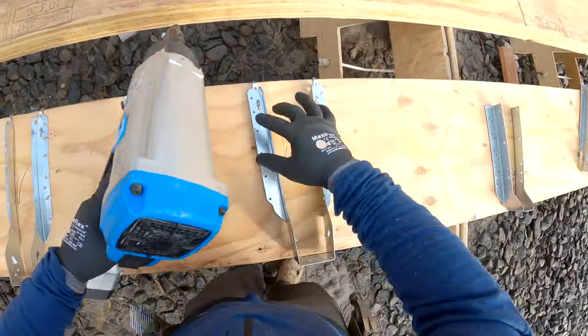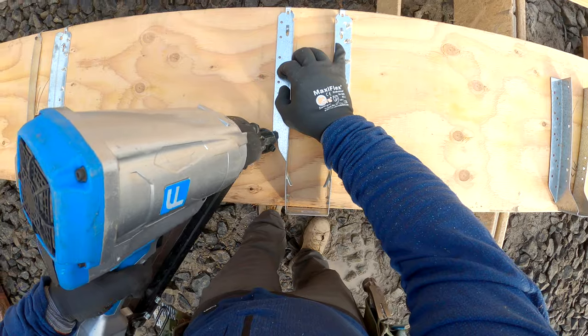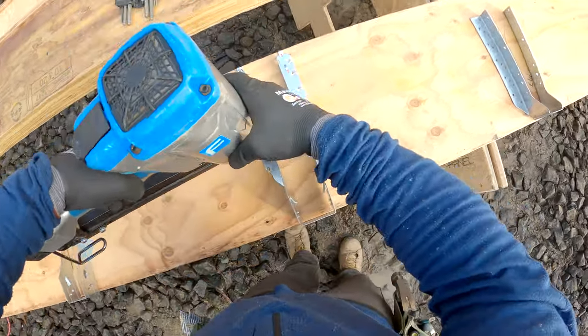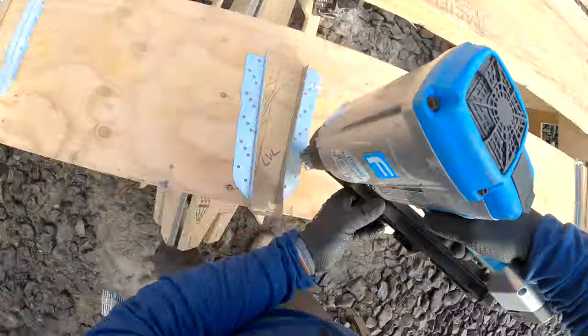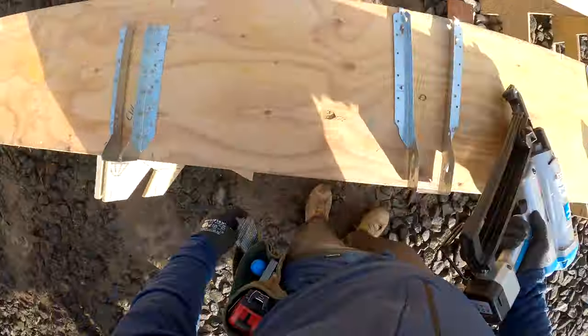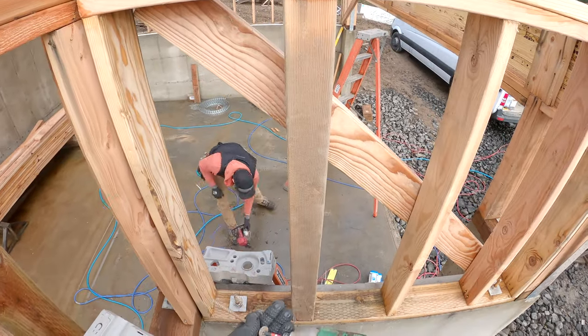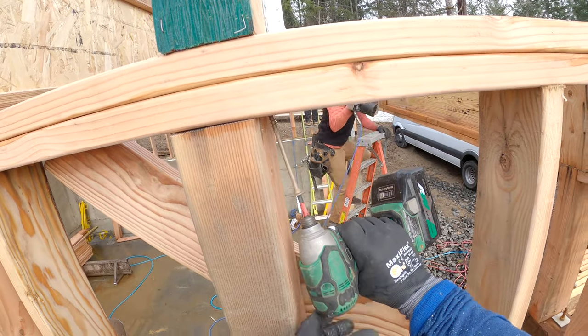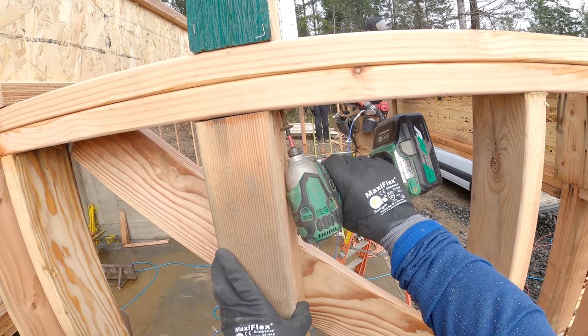This is a gas-powered positive placement nailer made by Beck America, formerly known as FASCO. You can read my review in the Journal of Light Construction. Makes real quick work of joist hangering — and yes, joist hangering is a verb. Whenever possible, we don't toenail our beams, but we use structural screws from underneath. Sucks them down nice and tight to the plate without splitting anything out.